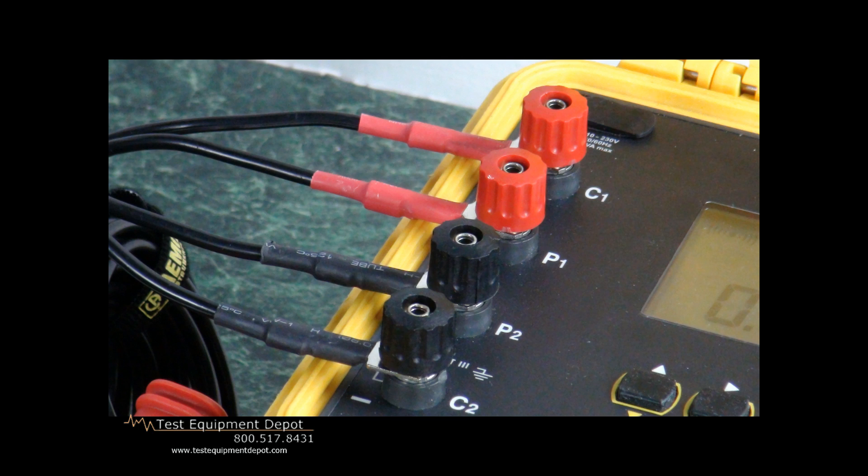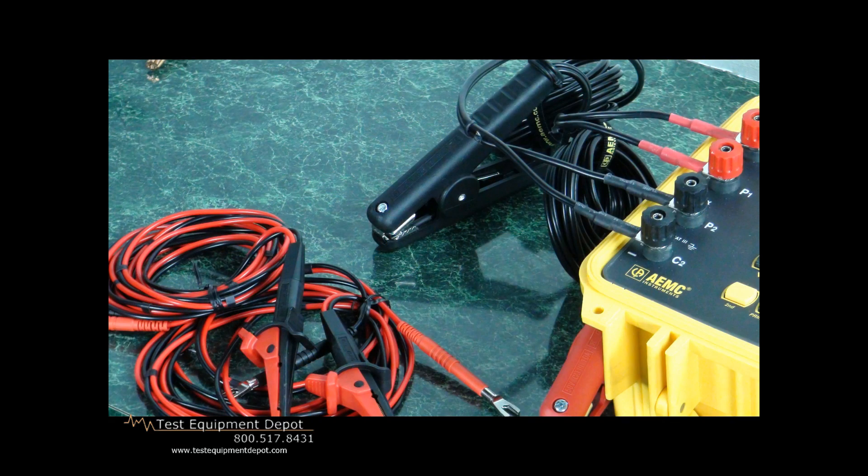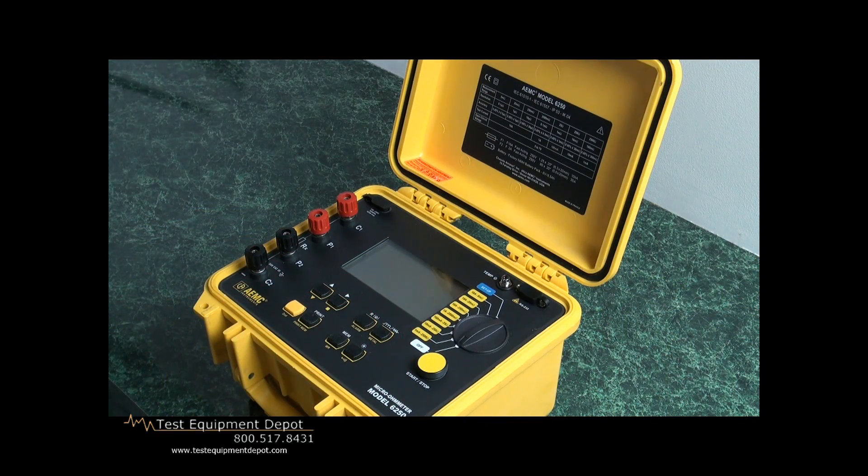We have four of the classic metal types — copper, steel, aluminum, for example. However, if you know the alpha, which is the engineering unit for resistance for that particular metal, you can actually dial that into this instrument. It has automatic or manual temperature compensation, and it has two programmable alarm set points where, if resistance exceeds a high or low desired range, it will flag an alarm.